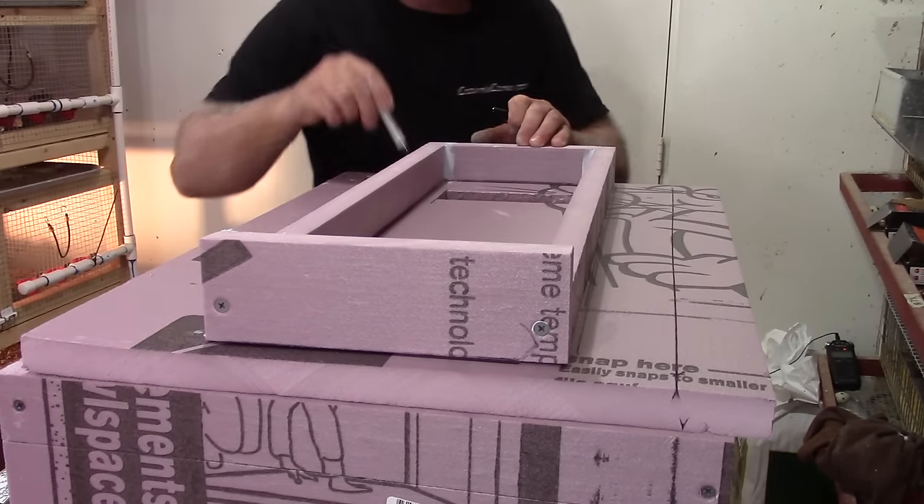I went ahead and cut out the pieces for the heating element enclosure. The bottom measures 16 inches wide and six inches front to back. The face plate is also 16 inches wide and eight and a half inches top to bottom. I marked and cut out the front plate circles, and I also 45-degree beveled both edges on the top and bottom. The first piece to install is the bottom — measured down seven inches from the top and marked the line inside, then turned the cabinet on its side to glue and screw it down from the top.